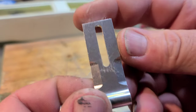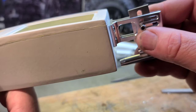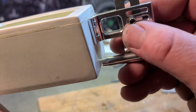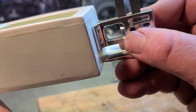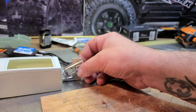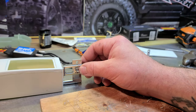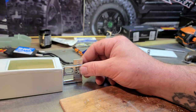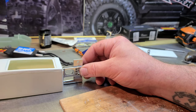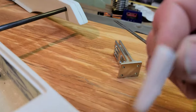We got it elongated. So wherever you decide to put your strut base, you want to make sure — like your first run — you want it neutral, basically in line with the bottom of the boat, and then you want room to adjust it up and down.